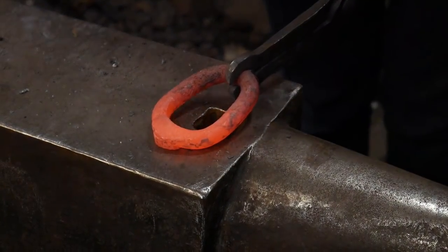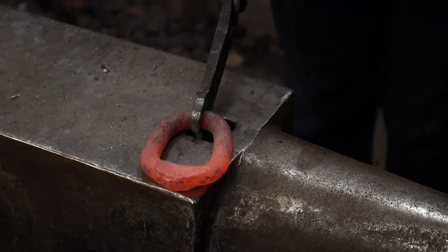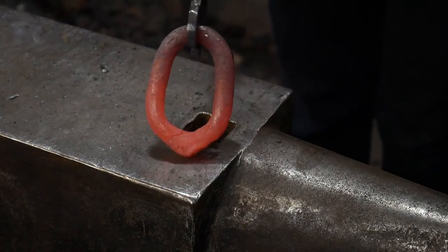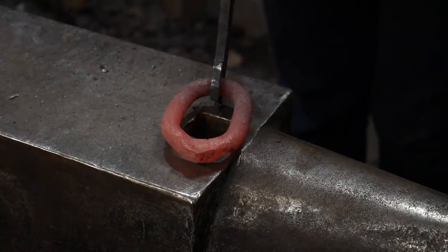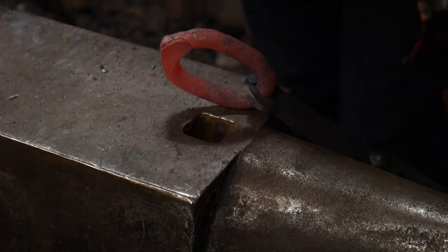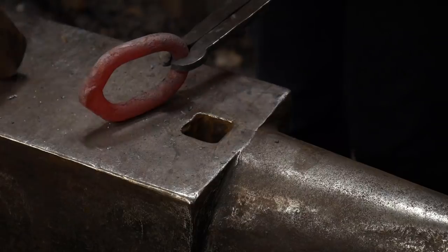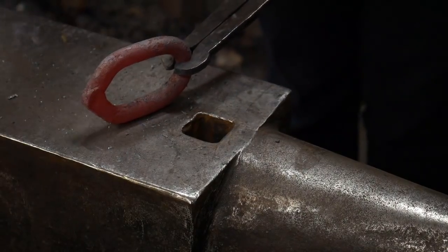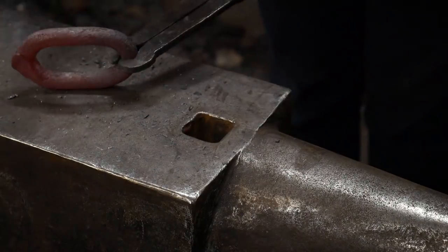Hold it still. All right. Hold it stable. All right, roll it around. Okay. Just flip it. There you go. And now tap the link to square up that link. So tap on that end, turn it up. Yep. On edge. No, up on edge, like I was doing my links. Yeah, and now hammer straight down there. Up a little bit. Just square up the sides.